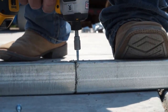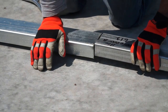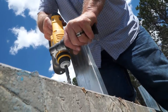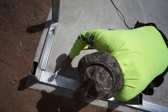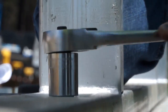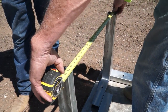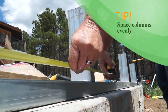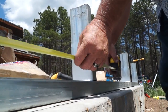Once you've unpacked your material, you lay out the base plate pieces where they belong according to your specific plans. At which point you begin by hammer drilling and anchor bolting through the pre-drilled holes in the base frame at one side of the wall into the concrete. As you roll that wall out, make sure your columns are perfectly spaced before you put your holes in the concrete to ensure perfect column spacing.